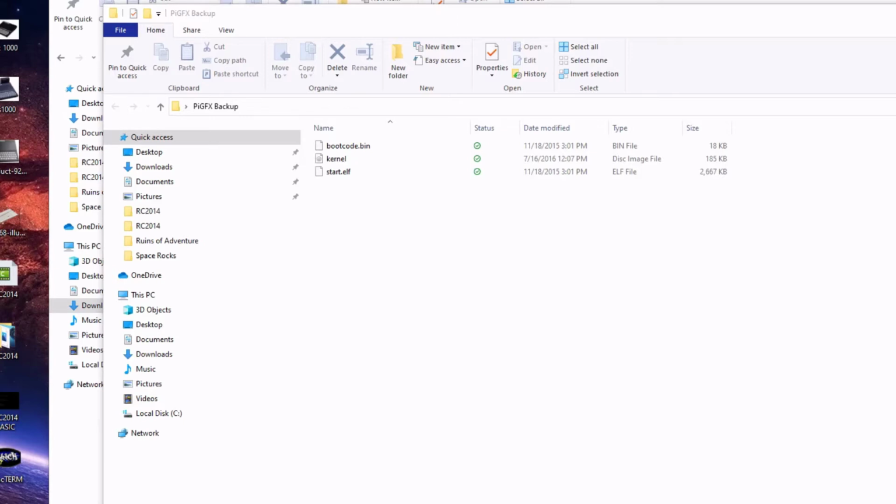Oh, nope. I'm sorry. There's one last thing you have to do. Once I got that in there, it started working a lot better, but I was having lots of bizarre issues. For example, when I'd go to run a directory command on CPM, it would only show me the very first file and then quit and drop me back to the prompt. And all sorts of other weird stuff.